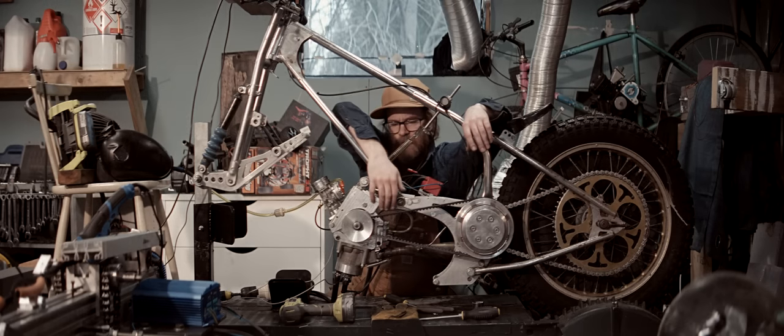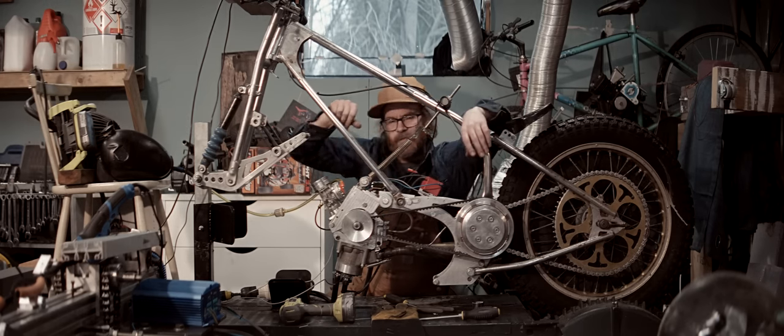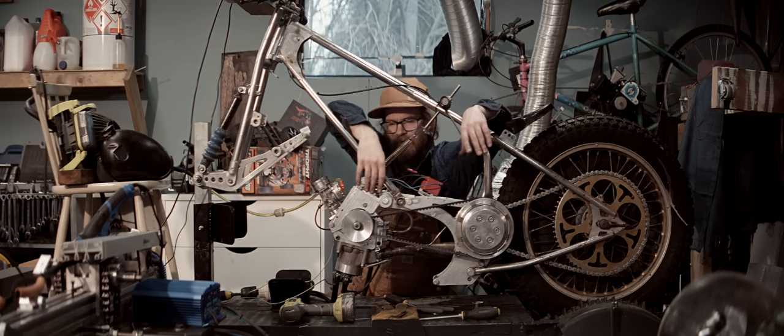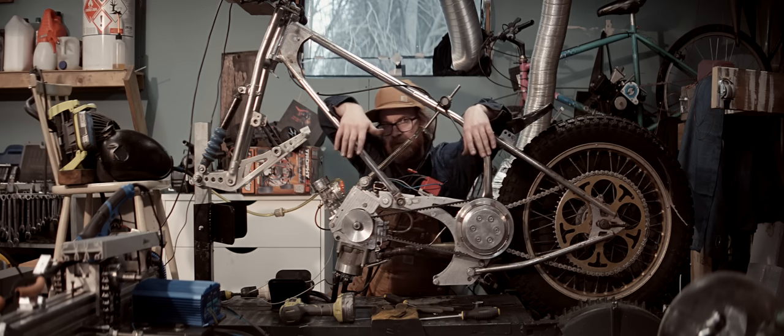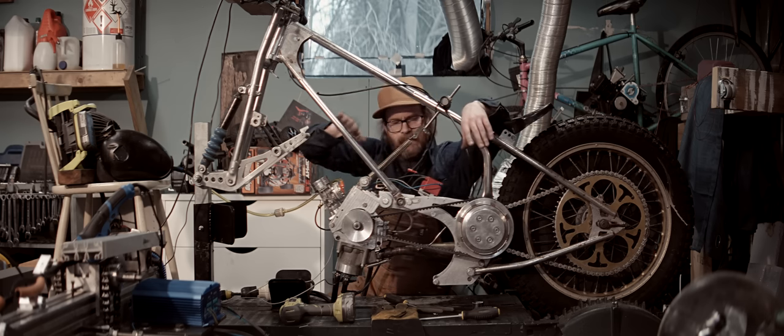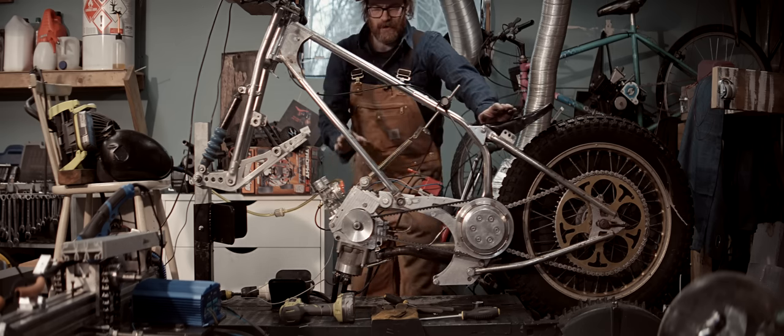Six of my lightest weights installed in the variator, and a guessed spring tension. Plan is for it to be able to run while the variator is gearing, let it gear out fully, and then perform a run. Let's see how it behaves.